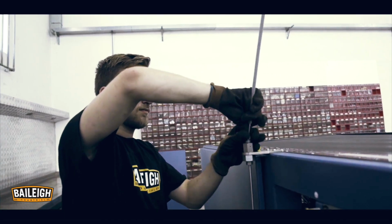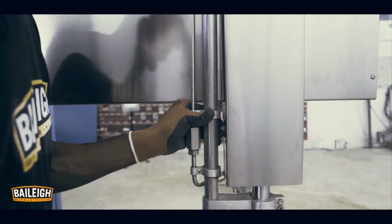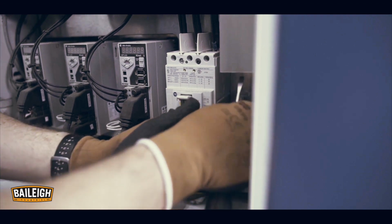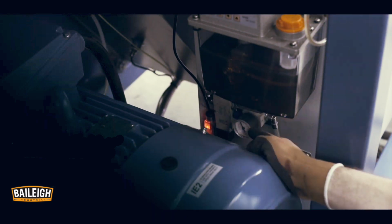Connect the high-pressure pipe. Tip: when joining high-pressure stainless steel connections, use suitable grease components on the threads for easier removal later on. Turn on main supply after confirming that all technical and safety criteria have been adhered to. Air pressure should not exceed 2 bars, 30 psi.